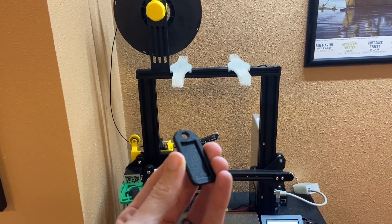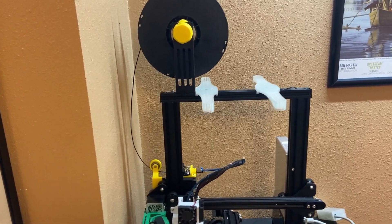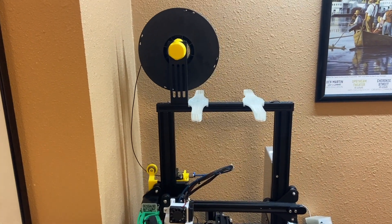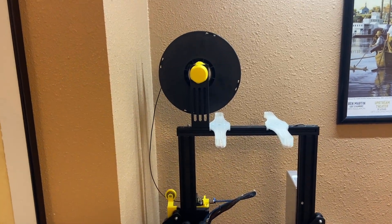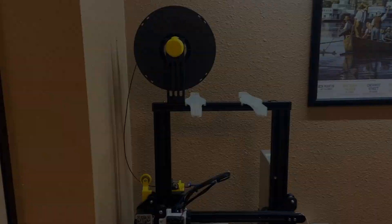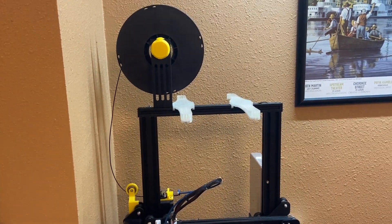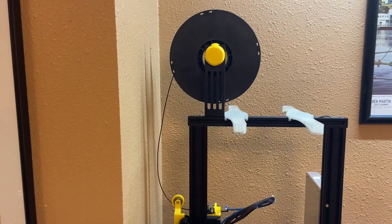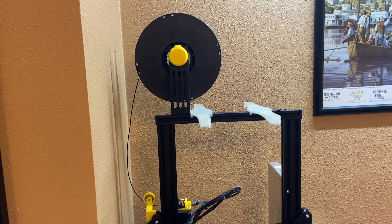I just printed this little key tag — it printed fine. Now I'm going to let it sit overnight just to make sure that it doesn't snap, because it often would just sitting overnight. The tension of that just pulling on the spool — with how brittle it was, even that little tension would cause it to snap. Okay, so overnight the filament is still unbroken. I think it did the trick. It dried the filament out, made it less brittle, and we'll see how long that lasts.